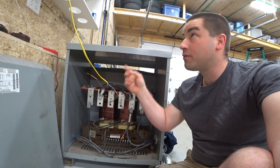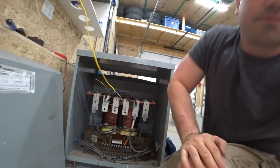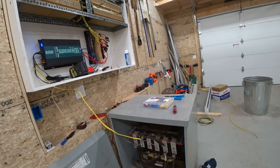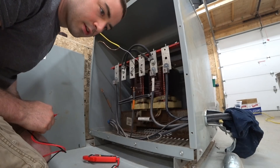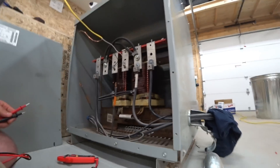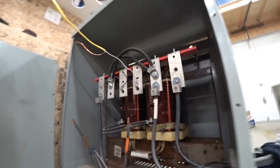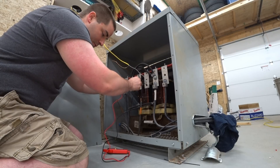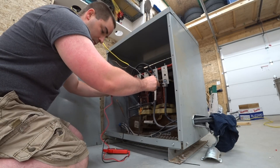I have a wire coming down from the inverter — let's just see what happens. There we go. I can hear a hum. From the inverter we have 115.7 volts, and then on the output side we have 57.8.